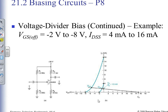So here we go. I'm using voltage divider curves. I have some voltage at the gate, a point that I know about. I know this point. I can find those two Q points once I have plotted my two transconductance curves. And then all things being equal, I go back and forth across that load line. Isn't that wonderful? Does that make any sense?